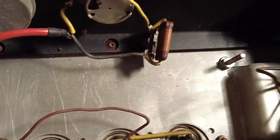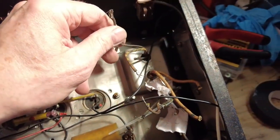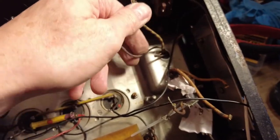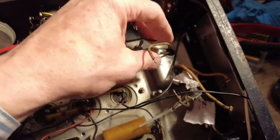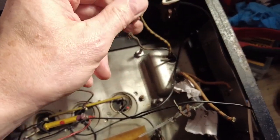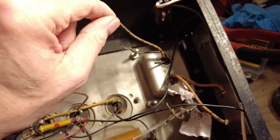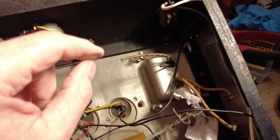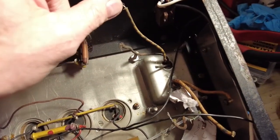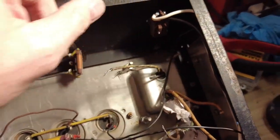Anything else? So we've got, obviously, the usual thing when you take a transformer off an amplifier, you've got short wires. However, the live will reach the switch, the neutral won't, and that's a ground as well, I do on there. So we've got that additional ground on there, which actually went to the cathode on one of the 6V6s, so they'd obviously elevated that ground.